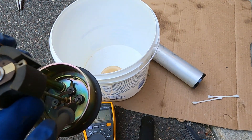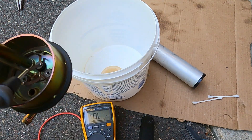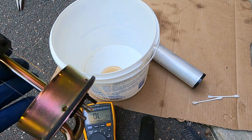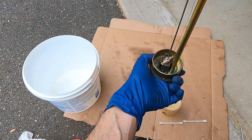Oh, look at that — that worked! What I did: I suspected that the crimp down inside here might be a little bit of a bad connection, so I held the end of the terminal up to the vise, put a nail set in there, and just tapped it a few times with a hammer. Figured that would tighten it up a little bit. It looks like that may have helped. I'm not going to mess with this anymore because if I do I'm probably going to break it and then I'll be buying a new one. I think it's time to put this one back in.